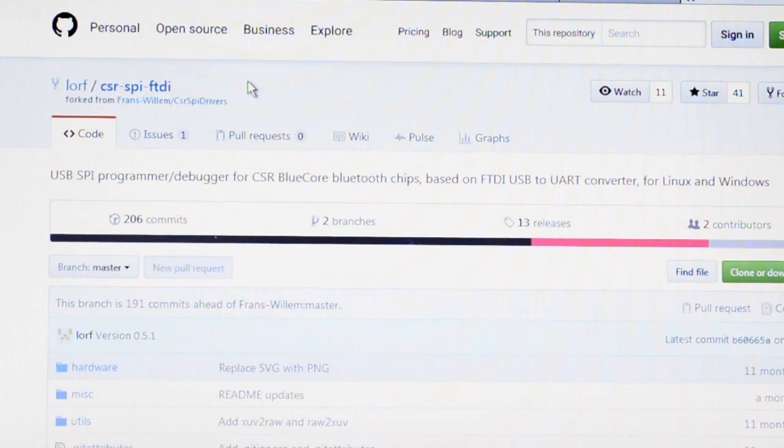As for the RN42 firmware, the legitimate thing to do would be to buy an RN42 module and rip the firmware from that, but that kind of goes against the spirit of piracy for me — so about 5 minutes of Googling will find you that. Then, in order to download it onto the HC05, you need the BlueFlash software from CSR. You have to register with CSR to download this, but it is free.